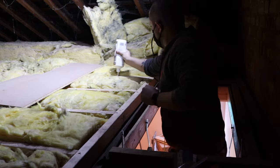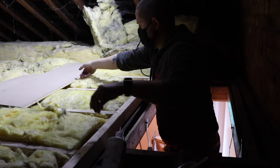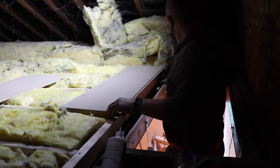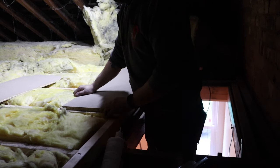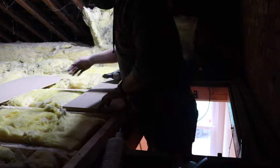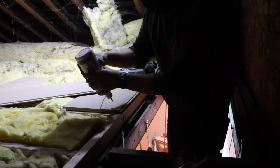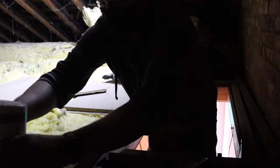So glued and nailed down here. If it was a floor down in a main living area you'd want to screw it, because the last thing you want is squeaky floorboards. But it ain't going to get any foot traffic up here, so nails are more than enough. And I changed out — put 63s in there rather than the 90s. But ring shanks again, just to make sure they don't come up. And that combined with the glue, it's not going anywhere.